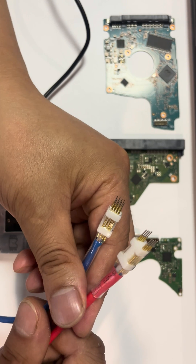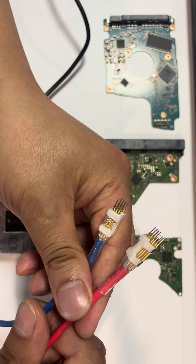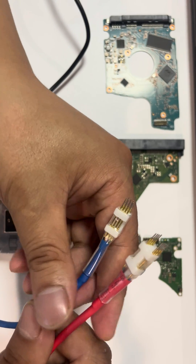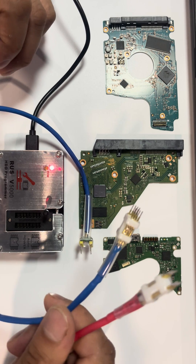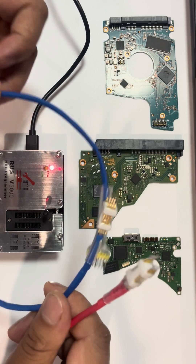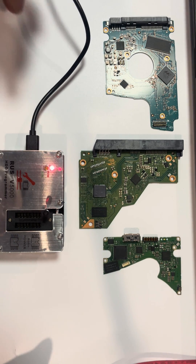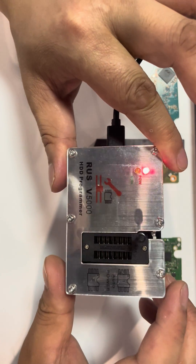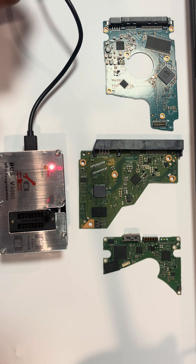This tool helps you read and write ROM very conveniently from different hard drive PCBs easily, without soldering the ROM chip off. Now let's check how we can connect this cable pin reader to the flash programmer — this is one special programmer from Dolphin Data Lab.